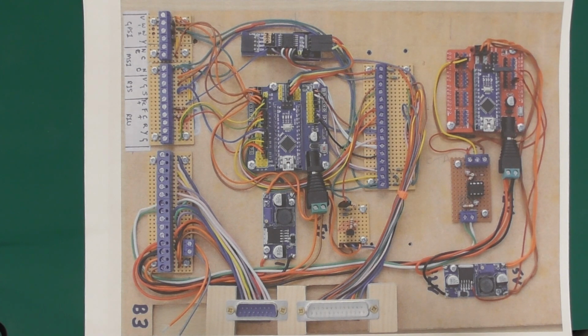And that is mostly, it seems, how signalling works on bidirectional tracks, if they are signalled. There are obviously bidirectional tracks on branch lines that have no signals, or very few, and are operated by tokens, whether they be manual or electronic. But that's another matter, and that's not what I've got here. I've got a main line, which is the relief main line, which can be signalled for either direction.